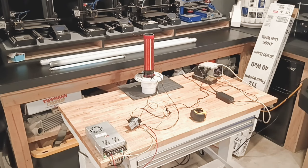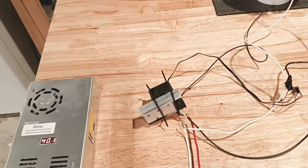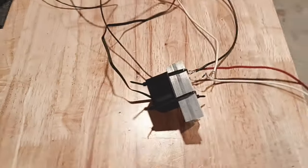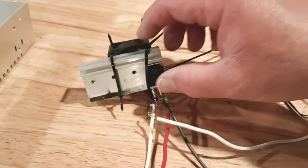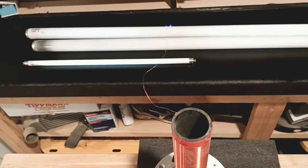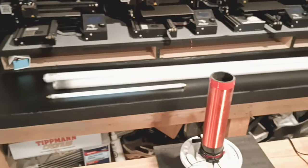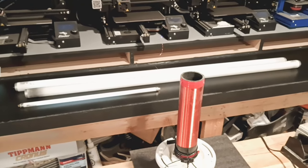So what you're looking at is this Tesla coil — it's been running for about 40 minutes now on the same MOSFET. We are at 40 volts. Here's the MOSFET right here, with just a little fan connected to a heat sink. Cool to the touch — that's cool to the touch. We have minimal breakout at the top, and that's good. I just want to see that it's lighting things up. As you can see, right behind it we're all lit up.